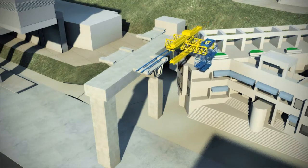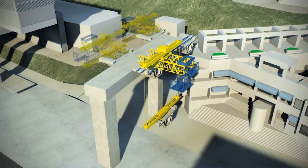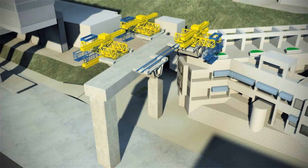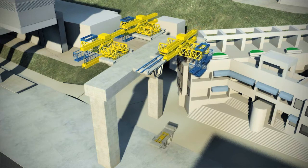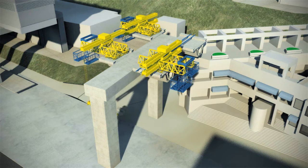In conjunction with Flatiron, we have developed a side slider beam and winch that allows us to erect segments over the cooked food market and adjacent to the Tai Wong Yi Temple with a minimum of traditional crane use. We plan to erect segments outside business hours of the cooked food market, thereby minimizing community and business disruption and protecting the MTRC's reputation as a good corporate citizen.